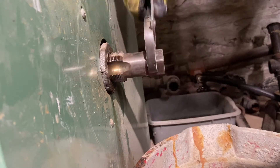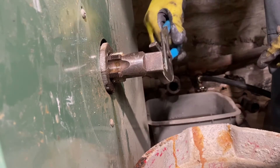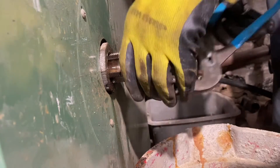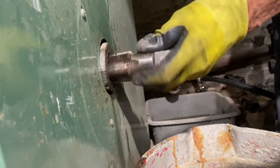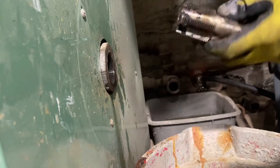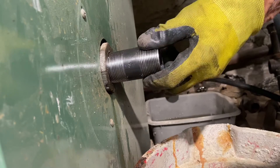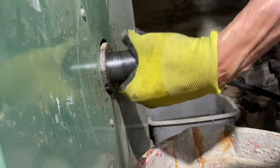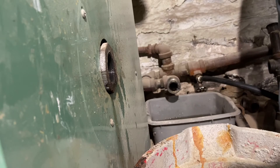On the new nipple I first used my lampwick — my spool lampwick — then followed that with Teflon tape wrapped around, and then followed the Teflon tape with my super-duper Blue Block thread sealant. That's basically a bulletproof way of doing things, especially if you don't want to come back for nuisance leaks. It works like a charm. I ran this nipple in there to see how it felt and it felt pretty good.